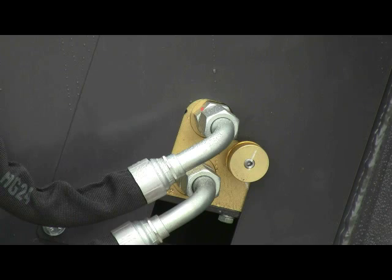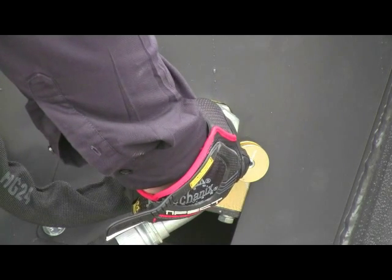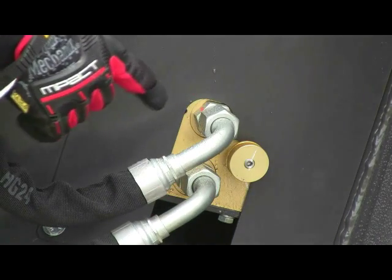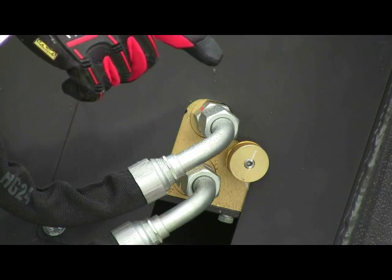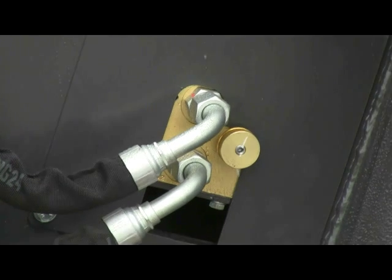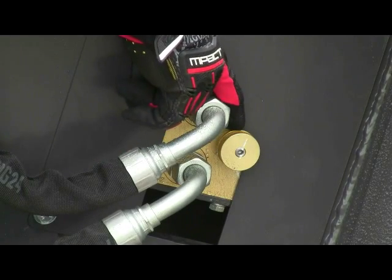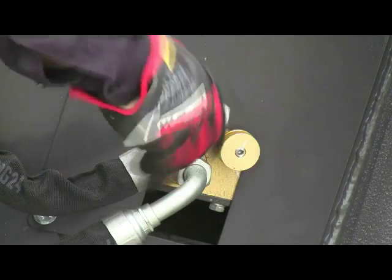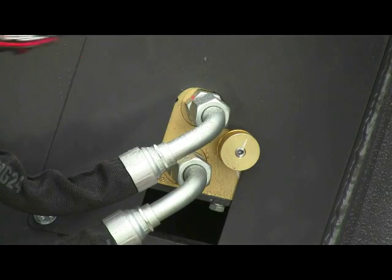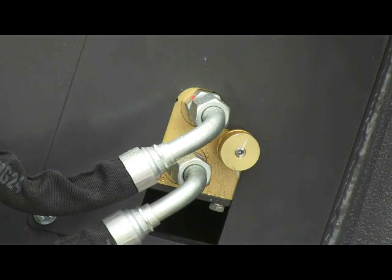That's very important. So what you simply do to adjust this valve, which will increase or decrease flow to the hydraulic cylinders that sweep the saw left and right, and to the depth controller. So to adjust this valve, there's a lock nut that you would back off, and then you would counter rotate or clockwise rotate the screw, the thumb screw here, to adjust your pressure to your desired flow so that it meets the requirements of your machine.